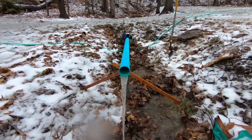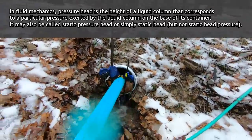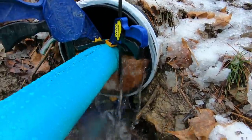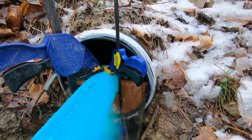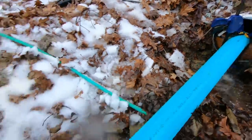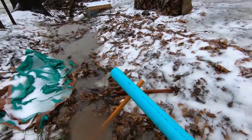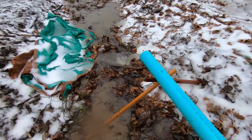I'm trying to gain as much head height as possible here, so I have the pipe not all the way at the bottom. You can see that water is spilling over because there's simply too much water to flow through the pipe. Even though I have the pipe at a fairly severe angle, so it's losing head through the pipe for that amount of flow.